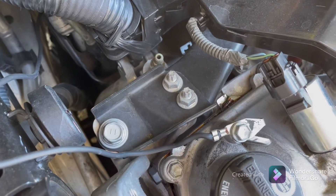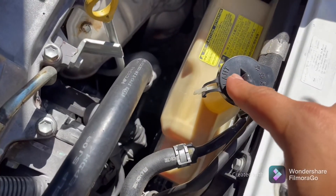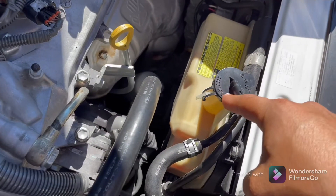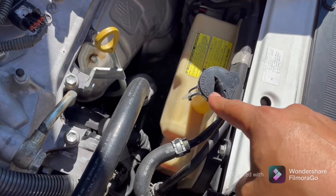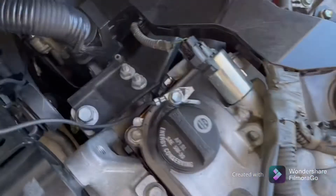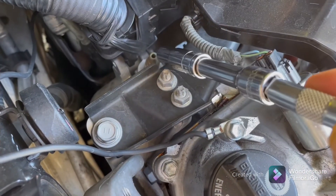While you're doing that, make sure your coolant reservoir is topped off. You're going to keep on filling it and watching the reservoir — you don't want it to go empty on you. Keep pouring antifreeze into your coolant as needed.